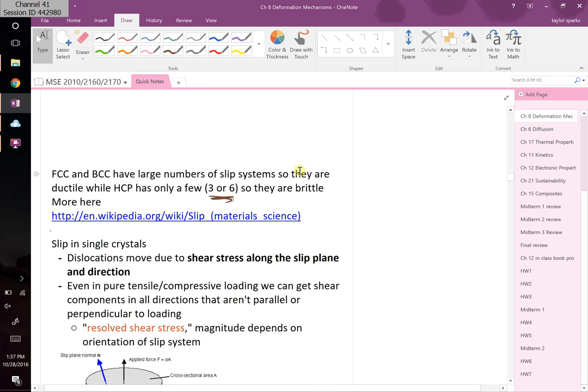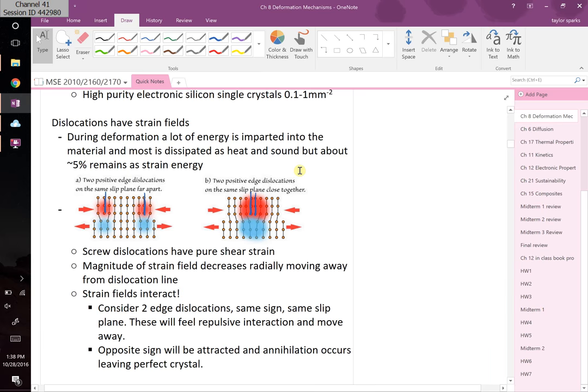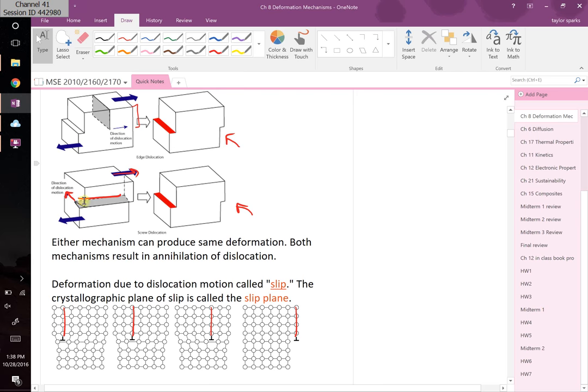Okay? Ashley? So here's a dislocation. Can I get a point dislocation? Switching places with other atoms. You said it doesn't happen as much? They can. So if you have a dislocation like the screw dislocation, where it's an entire edge that's kind of offset, does that move as one? Yeah, this whole dislocation line, imagine like the core of your parking structure, where the helix goes around that, that whole core would move, right? So all those atoms are moving together. And why do they move together? Well, because if one of them moves apart, it creates more strain than if they were to move together. The overall energy is reduced by having it in a nice line. Basically, if it splits, it creates a new dislocation. That can happen, but it's lower energy for it to all move together, right?